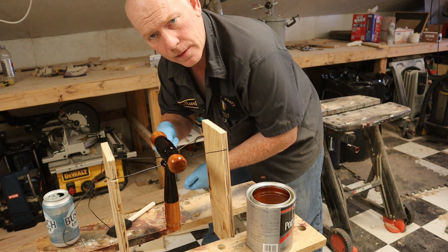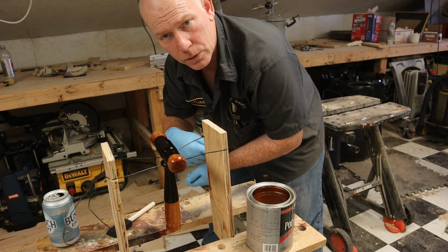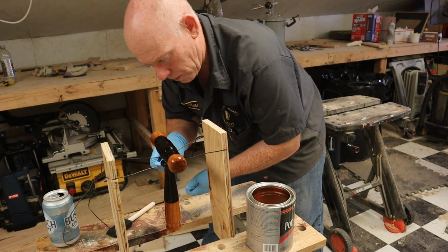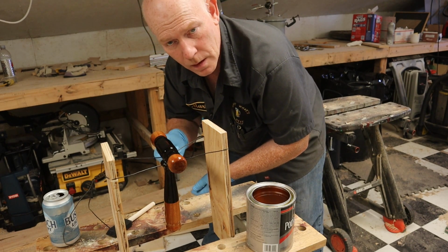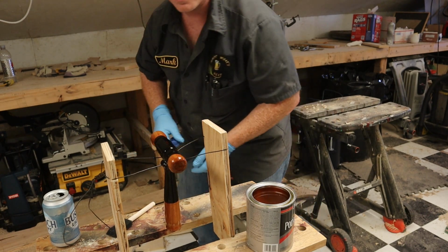I will finish this later because I gotta come back. After this dries, I gotta sand it with 220, another coat of urethane, sand with 220, another coat of urethane. And we'll get back to this next week because I gotta go to work tomorrow. Just kill me. I'll see you next week when this is done and we'll do the big unveil. All right, later.